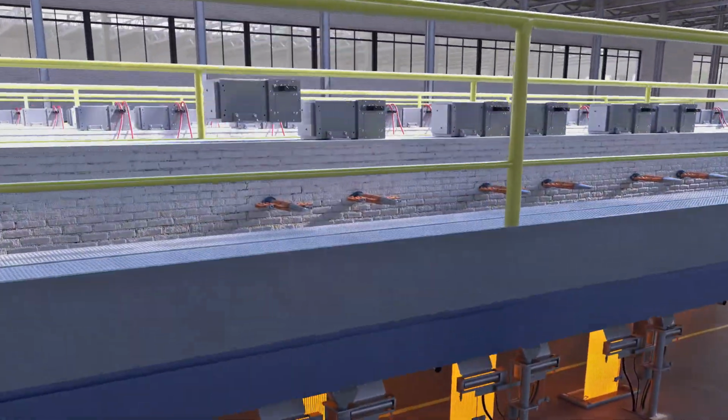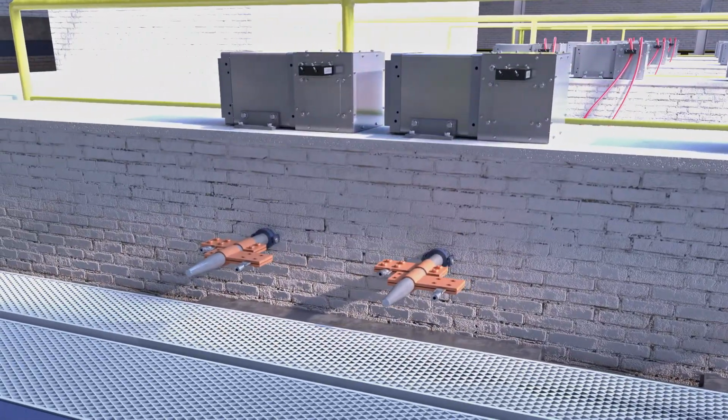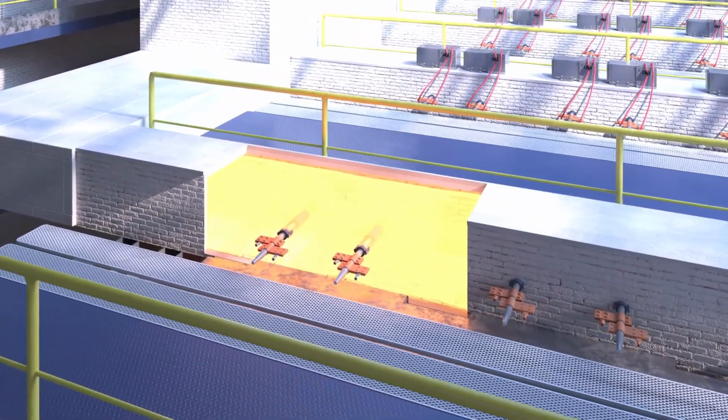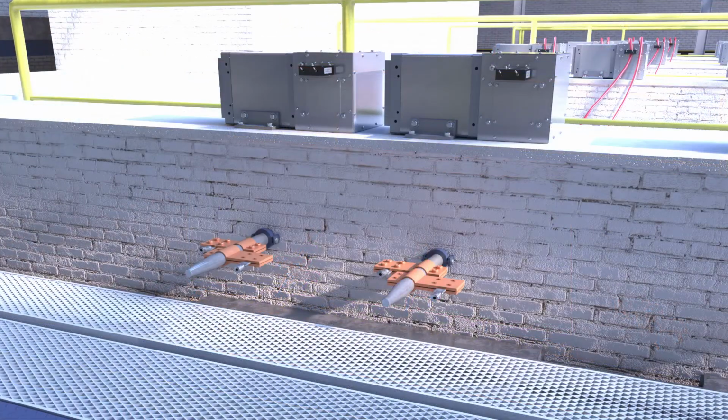RoMan transformers are uniquely epoxy encapsulated, eliminating the need of costly filtering equipment to protect transformers from dust and debris. Because of their smaller size and weight, the RoMan solution can be close coupled next to the forehearth or near existing catwalks, helping to maintain optimum temperature of the flowing glass. We can also provide integrated mechanical mounting solutions designed specifically for your application.